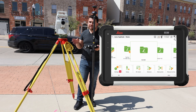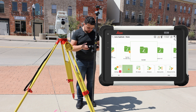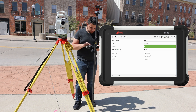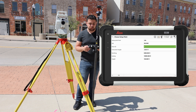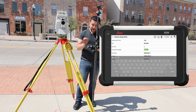I've got my total station set up on point number one. I've loaded Leica Captivate on my controller and I'm going to go to setup and start by setting the orientation for the project since I have no data. I'll be using point number one, which I've assigned coordinates 5,000 for the northing, 10,000 for the easting, and 100 for the elevation. I've measured the height of this total station and it comes out to exactly five feet.